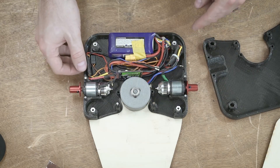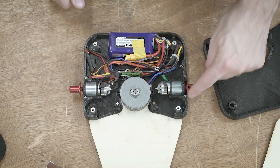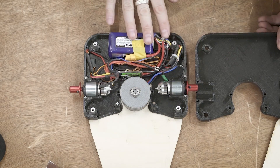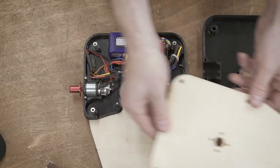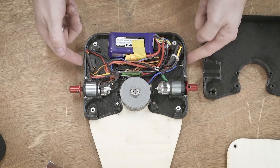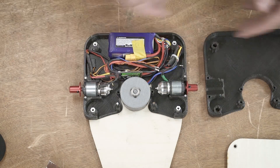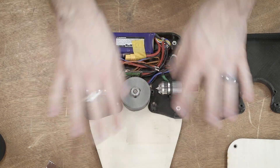I'm going to do a different method similar to what I had in Anxiety Attack and a little bit like I had in Long Long Man. You might also notice I've got six of these posts that key in and align to the top plate. The top and bottom plates are actual mirror images of each other. I wanted the top frame and the bottom frame to be mirror images — that's why this one has all the bolt hole patterns on it as well as this one. I wanted these pieces to be top and bottom mirrored as well so I really only have to have that many duplicates — I don't have to have unique top and bottom plates or unique top and bottom trays. These are just PLA for right now; they will be nylon-G.